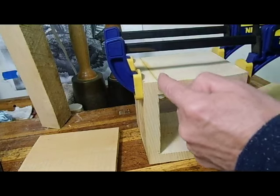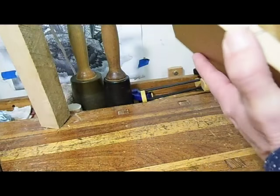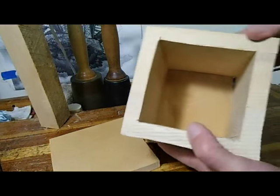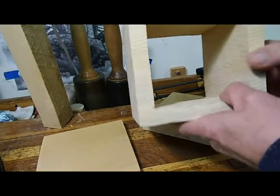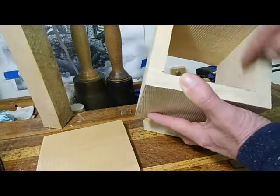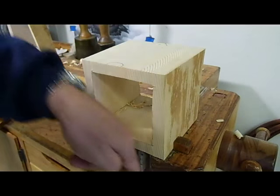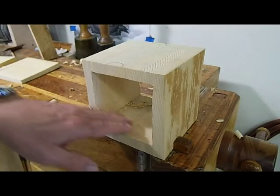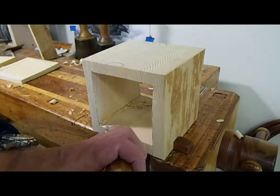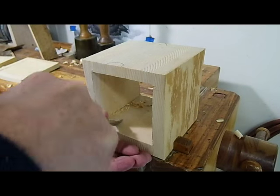At the spot where we brought the band saw in, we glue that joint, then we'll put on the top and the bottom. First I'm going to make an outline of the bottom so I can smooth that off, and before I glue it I'll do the smoothing. Then I'm going to take my chisels and smooth the inside and finish it off. With the top, the grain is going this way — this is all end grain — so smooth that off. It's easier rather than pushing the chisel straight forward to put the chisel on an angle; you're using a slicing action of the blade and it makes a smoother cut.